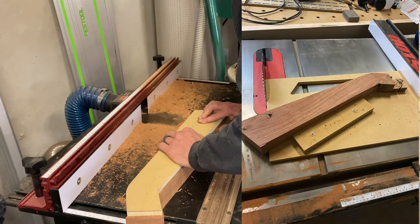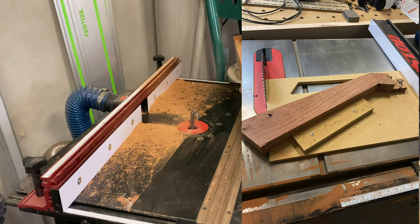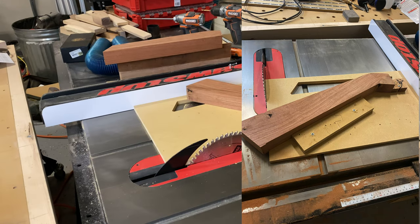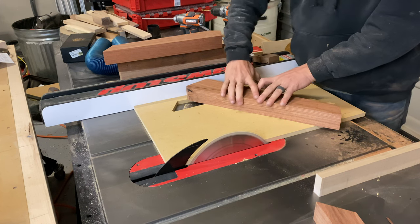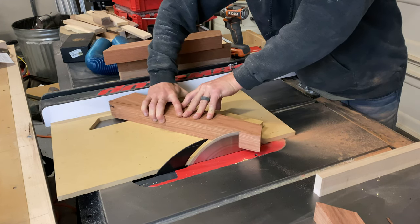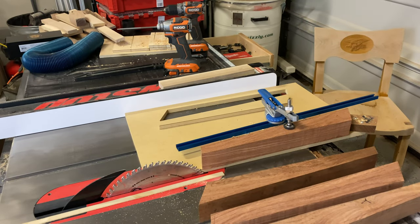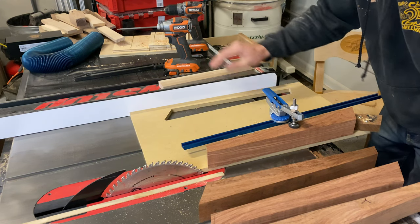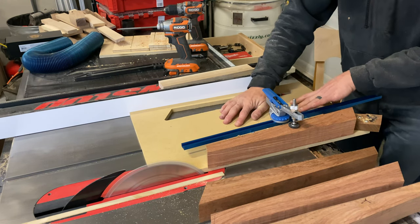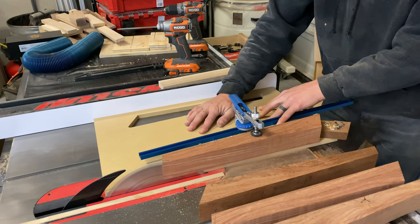Once flush trimmed, I made a little jig out of some scrap wood and used my template to set it up — that's how I cut the angles I needed on those legs. Here I'm cutting the stretchers for the table base. This is a great way to safely and quickly make repeatable cuts and repeatable tapers. You don't necessarily have to buy an expensive taper jig — you can just build your templates and use them to set up your jig.